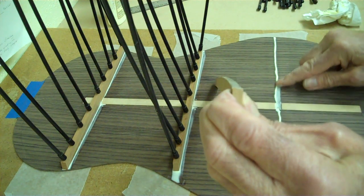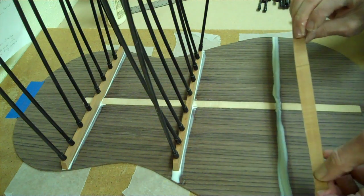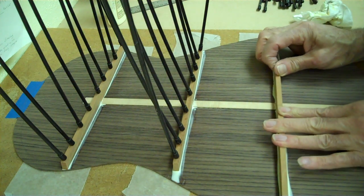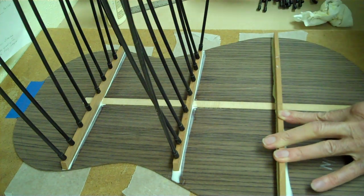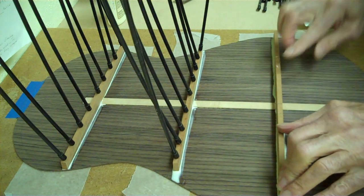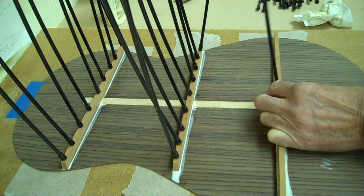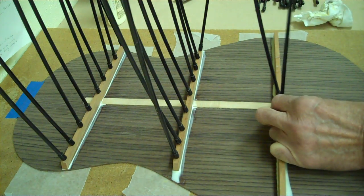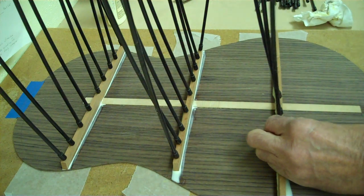I don't know if you can see the slight curvature on that brace, but I actually sanded the first several by hand. When you radius them by hand, I couldn't find an easy way to do it. It was all time consuming. It was taking me approximately 2 hours, just a very gentle sanding on this form with a piece of sandpaper laid on the form, going back and forth about 4,000 times or so.